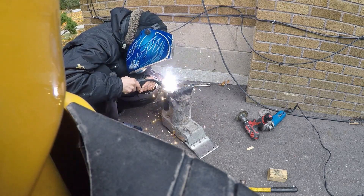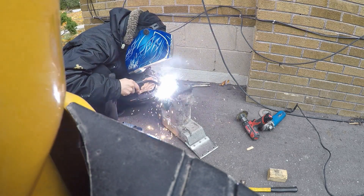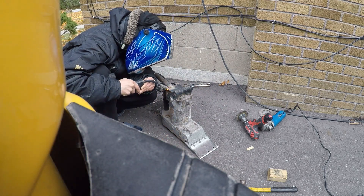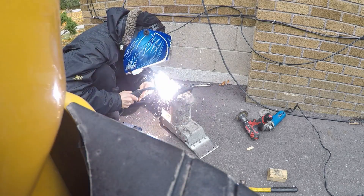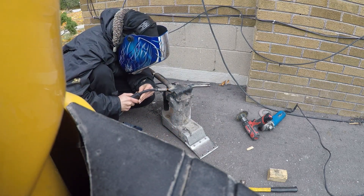Really just trying to pull the bead along until I reach the edge. What I often like to do is convex the end a little bit to give it a bit of a ball and a little extra strength, so we don't experience any cracks in the future again.